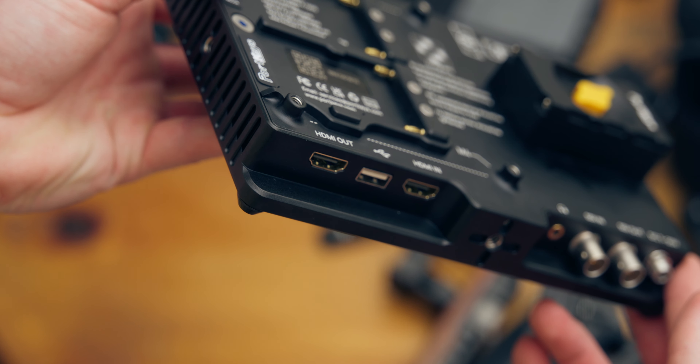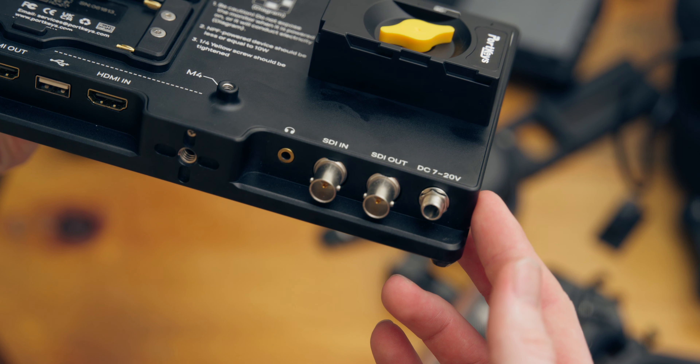If you have a hundred-thousand-dollar camera you'd probably get a SmallHD or something like that, but you could use this on one of those. It has HDMI and SDI so you can use both. SDI is kind of an industry standard — I don't have any SDI cables yet but I'm going to make a video about HDMI versus SDI so stay tuned. One of the benefits of SDI is it uses the BNC connector, which is a locking connector, meaning it cannot just be accidentally yanked out and you can't easily bend the cable inside the port like you can with HDMI.